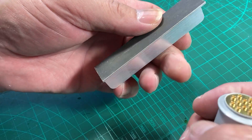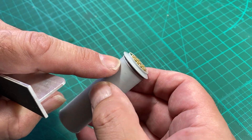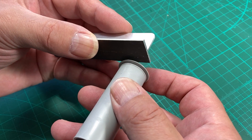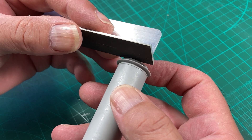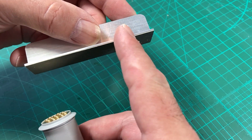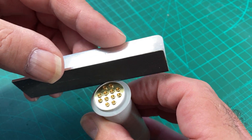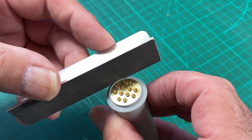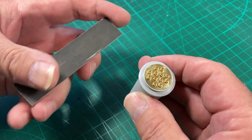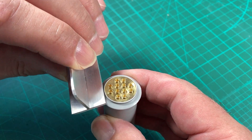With all the flat scraping done I'm going to remove the molded-on ridges with a curved blade. You don't want to overdo this because you don't want to scrape in grooves or gouges — just scrape enough to remove the high points. You can still see a bit of a shadow; if you get rid of the shadow you've probably gone a bit too deep and it might show up in the paint as grooves. With all the scraping done we'll go into sanding. I'm going to use a rigid sander just to re-establish some of these sharp edges, using 1200 grit to reduce the likelihood of putting flat spots in.